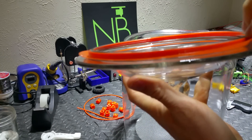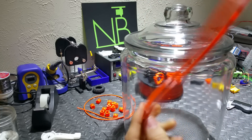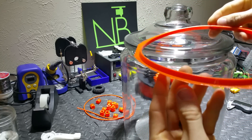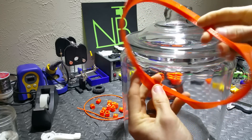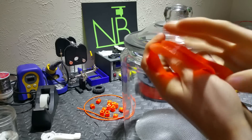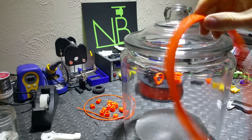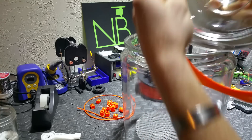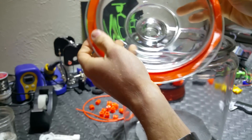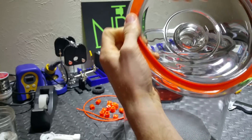This is my acetone vapor polishing chamber. I got this big glass jar but it did not come with an O-ring to seal the lid. I figured I could print an O-ring, but I didn't know how NinjaFlex would hold up to acetone. So I soaked one of my vibration dampeners in acetone for 24 hours — surprisingly it didn't melt, though layer adhesion became a little weak. I decided to give it a shot, and I've used this chamber on a few ABS parts already. The O-ring doesn't show any signs of damage, and I'm pretty sure this NinjaFlex O-ring will hold up to a lifetime of vapor treatments.